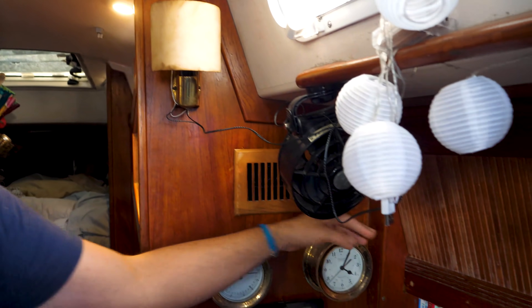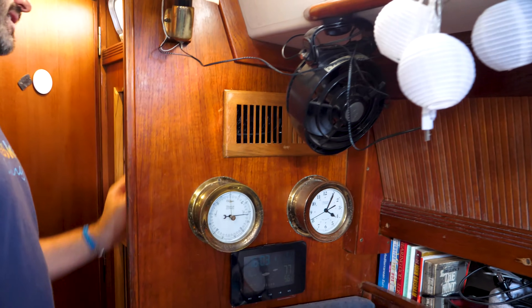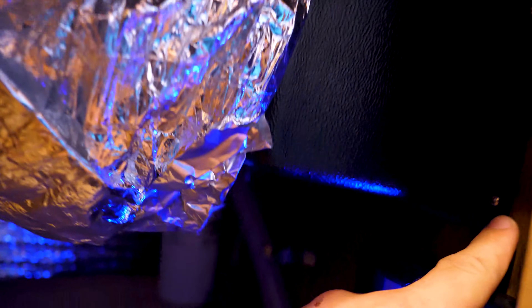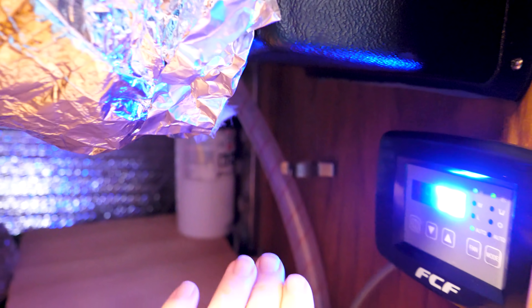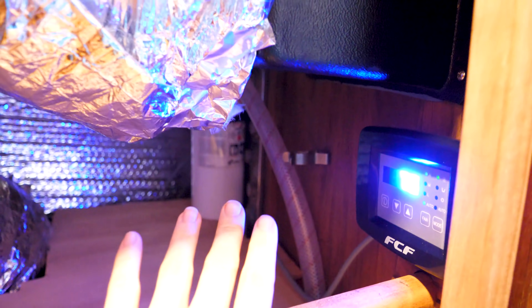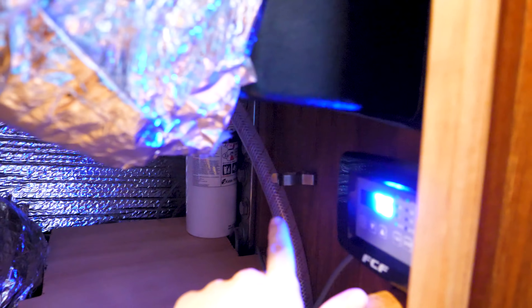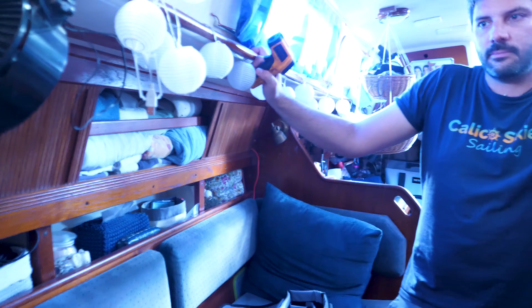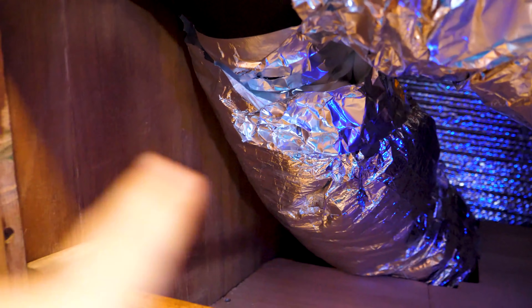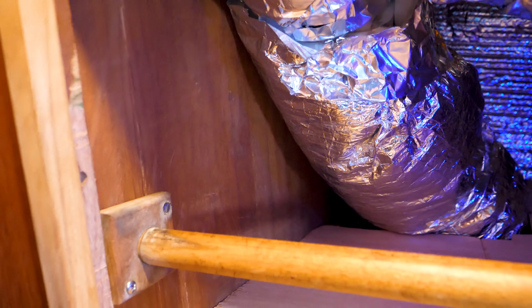This is the drain — the condensate water drain. Here's our salon vent. The consideration for where to mount it: we don't want to get too close to the main chain plate and cap shroud here, so we kept it more to the left. But you also have to be inside the closet — you can't be out here because this is part of the bulkhead. It's basically right on the edge of where we can have it inside, so our chain plate is there. We're trying really hard not to affect the integrity of the chain plates.